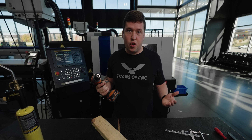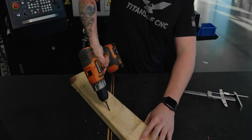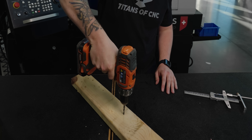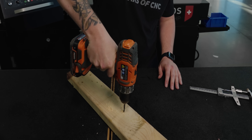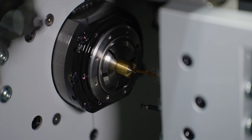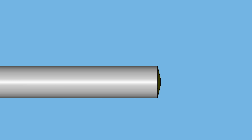If you have to drill an angled hole in anything, it's kind of hard to do it like this. I guess you could force it in like that, but it's not going to really work that well. It's always easier to drill when you have a perpendicular surface to your drill. Stupid easy, right? So that's exactly why I turned the 75-degree angle to match my 15-degree angle so it'd be exactly perpendicular. After I drill those holes, I come through and I just turn away the material.